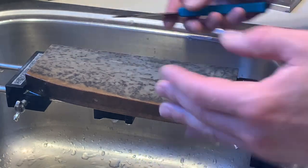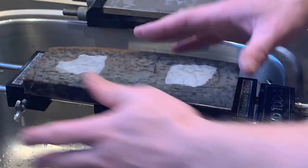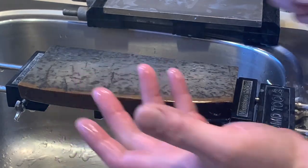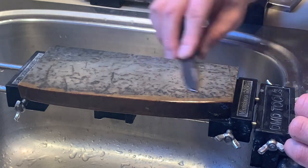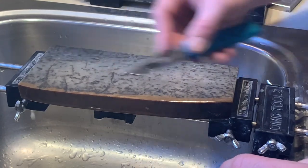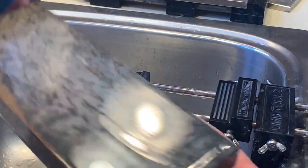If you have re-profiling work to do, you can either sharpen right on that diamond plate pairing, or take the back side of your stone — on this one it's lapped to a rougher finish, prepared with 120 grit, so the texture is actually showing more grit particles. Even though you have the same type of stone, you'll hear the big difference in the sound — much more grabby. This side gives you a toothier working edge, and then if you switch to your finer side you're doing fine honing.